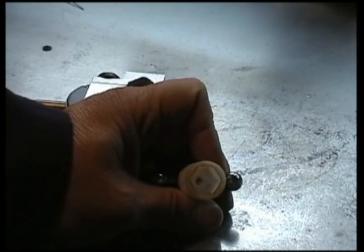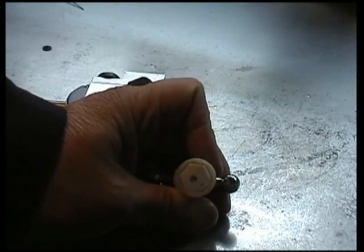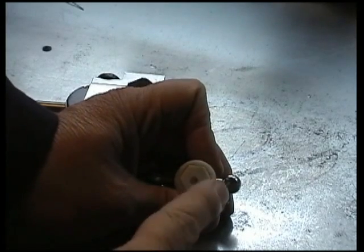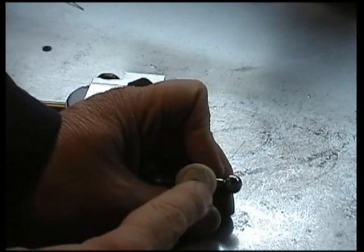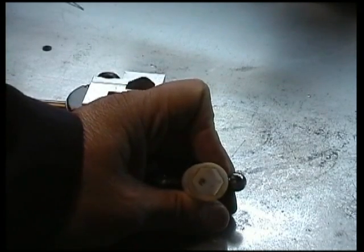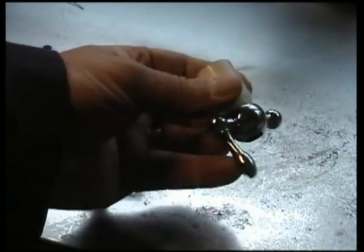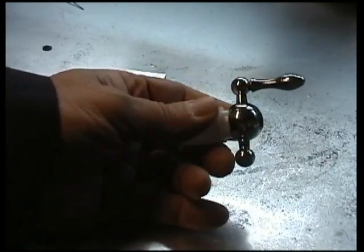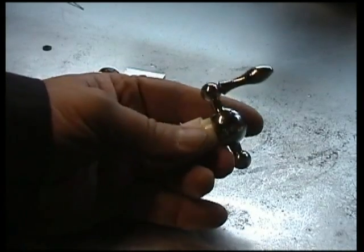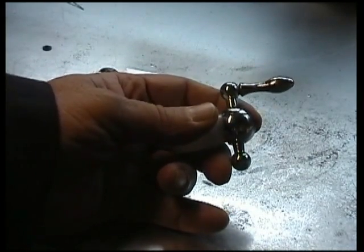Each hole is 2mm in diameter. I then bored out the hole to 14mm and then finished the sides to flatten them and make the hexagon using a 3mm mill. I then just used a hand crank that I purchased off eBay and that fits on the end of the lead screw.